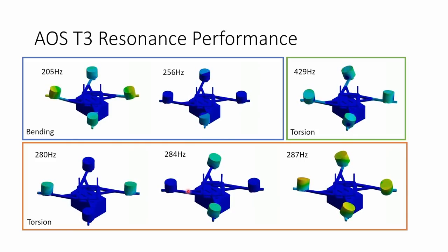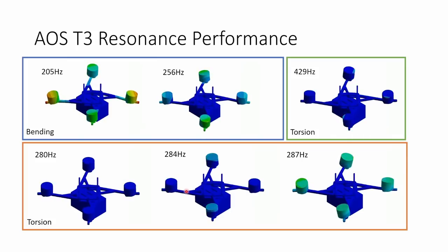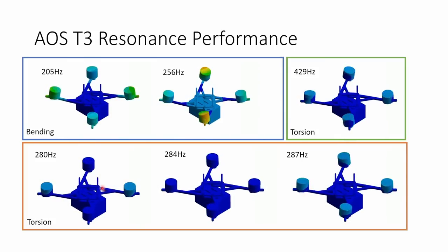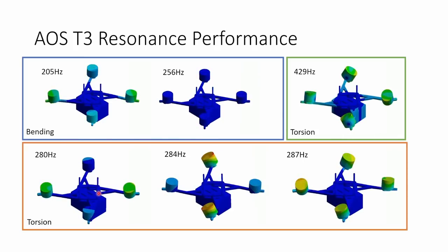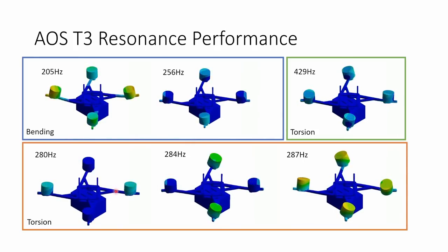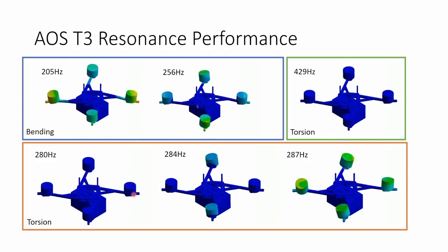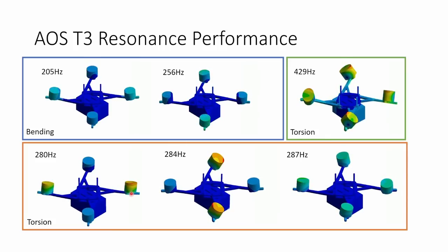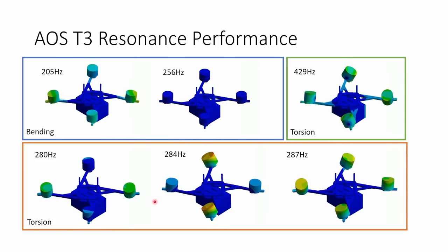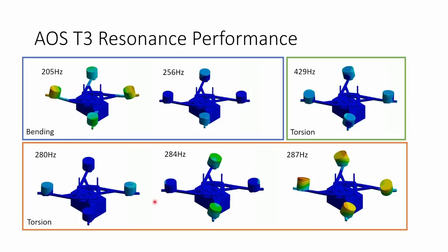You can see that the strut here that comes from the middle of the frame out to the arm is providing a fantastic amount of support for these twisting torsional modes, because the arm really can't twist beyond that strut because of that wide base there at the root of the arm. And so all the twist is confined to just this very short length between the stabilizing strut and the motor. And that adds a lot of stiffness and helps push those resonant frequencies up really high, nearly 300 Hertz in this case, so that again, the filters can be really effective and eliminate those vibrations without introducing any significant delay